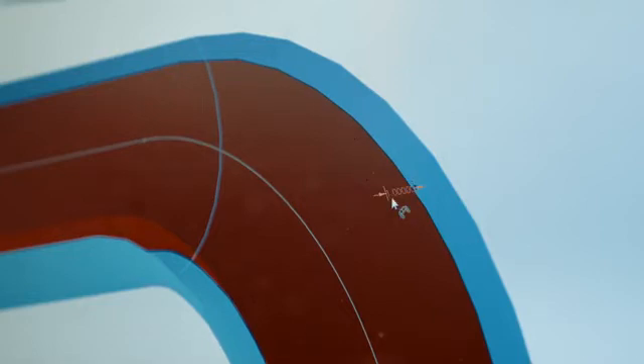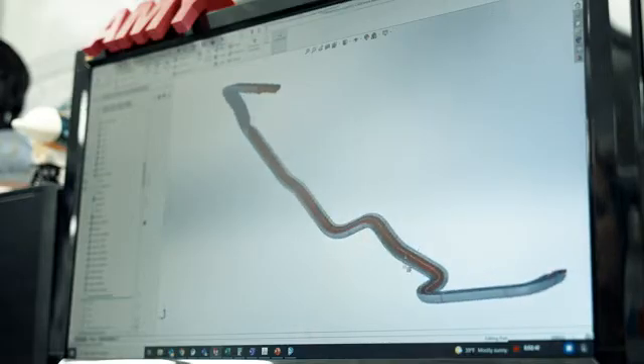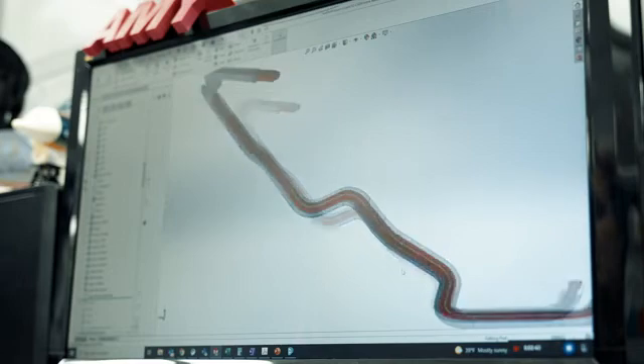In CAD, offset the surface of the part you're measuring a small distance — about half a millimeter. This is the surface your part lays on. You can keep it as one surface or divide it into pads that support the part at various points.